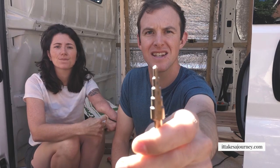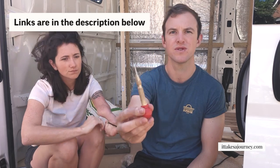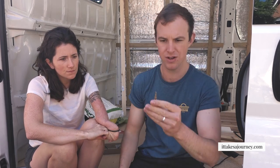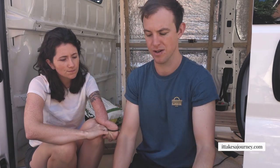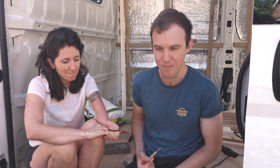Useful tool: a tiered metal drill bit - it was in a whole set. It also came with a punch that's spring loaded so it fires - really useful when using this because this starts at 4mm and can sometimes go a little bit haywire, as in doesn't drill exactly where you want. So give it a blam first.